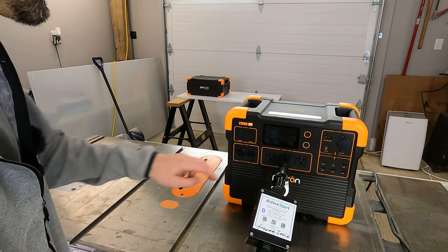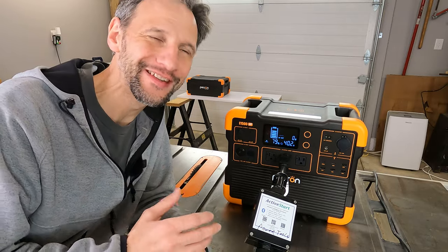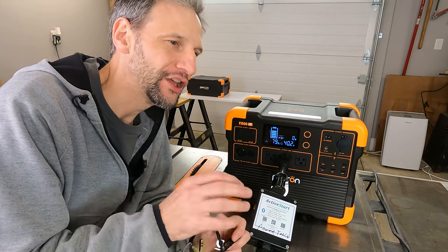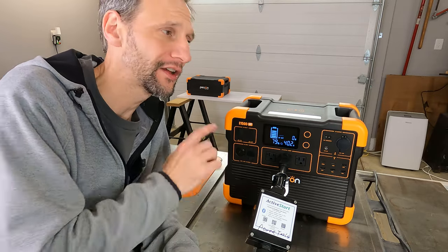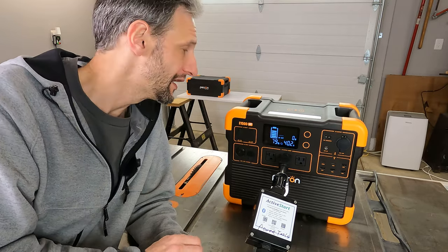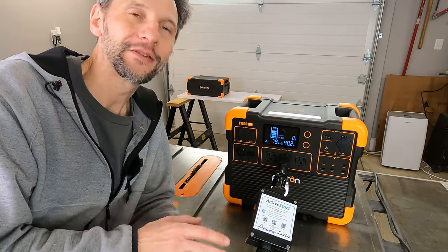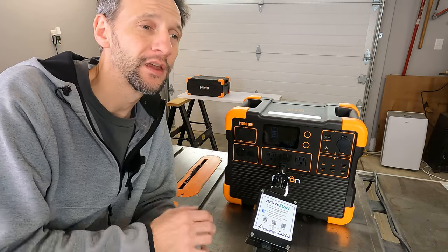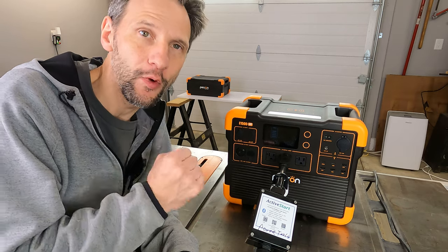So you can see it almost gets there. And this has some special software and hardware in it that starts the motor a lot more softly. I'm using a version of this to get these kind of inverters to work with my heat pump. But there's some tuning yet to do. Hopefully we'll get there. Nonetheless, most power tools, hand tools, chop saw, things like that will be fine, but the larger 1.5 horsepower tools, this unit doesn't have quite enough to get them over that start.